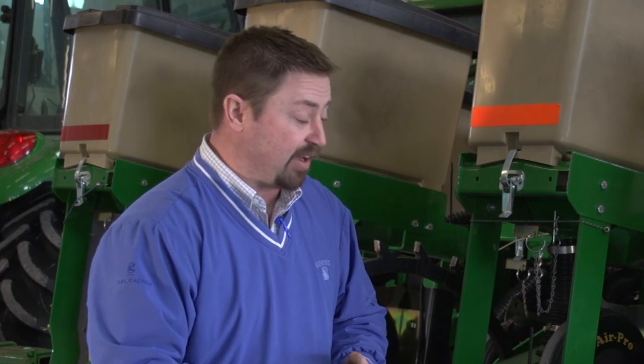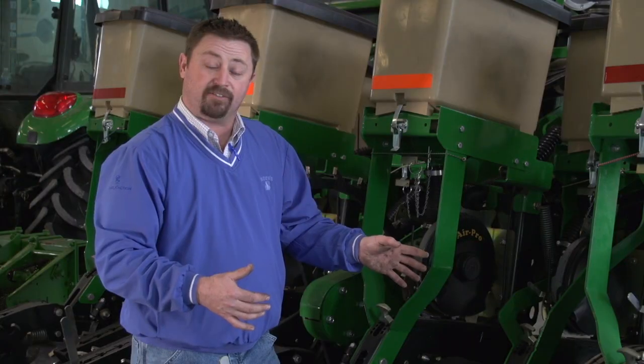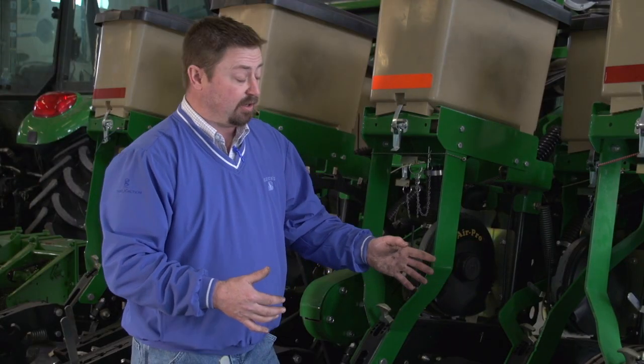If we're seeing a lot of planter chatter, we need to slow that planter down and see if that chatter continues. If it eliminates the problem, well, you found the situation that we had, we were just planting too fast. If the chatter is still continuing to happen, even when you slow down, we have to start analyzing the planter and find out why that planter is moving on us.